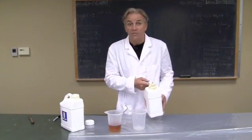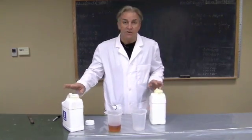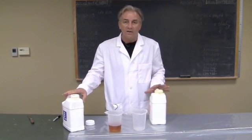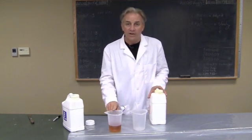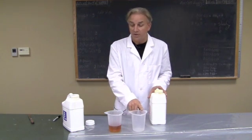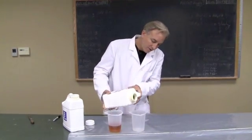To demonstrate how this liquid foam is actually mixed and used, we first conditioned our liquids to 72 degrees Fahrenheit — that's the best temperature to be at. Hotter means a fast reaction; colder means a slower reaction that will create a higher density foam than desired. We're going to measure out equal portions of liquid. In this case we have some pre-marked beakers, and we measure out part B and then part A.